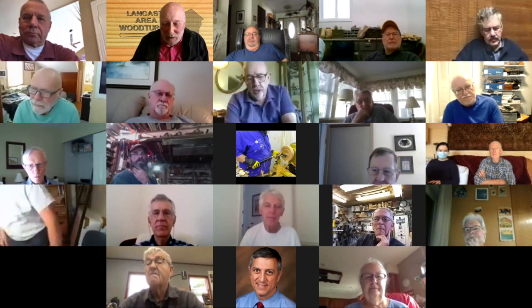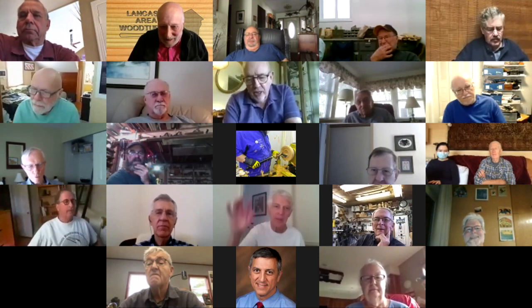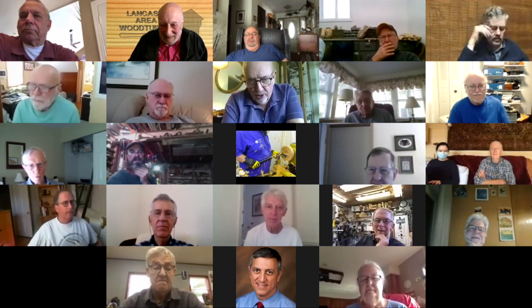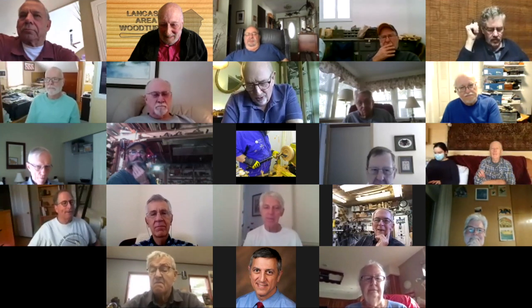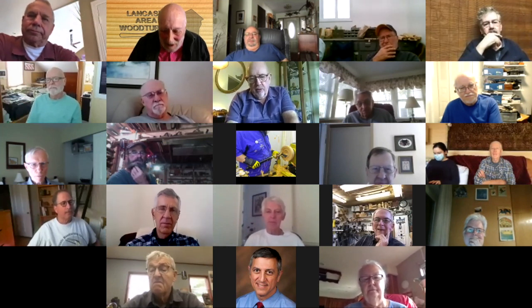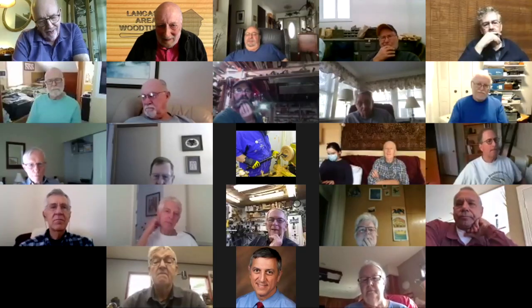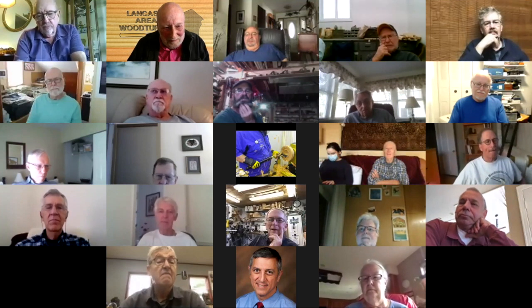A hat happens to be a shape that comes naturally out of the tree for some crazy reason. And as you can see, the bowls, I make all natural edge. Sometimes the bark goes off, but I've been pretty good at keeping it on. That way I turn it to the shape I want and let it set and let it do its thing. Because if it wants to move, it's going to move either way. And you won't see it with the natural edge.